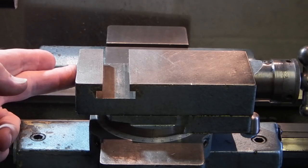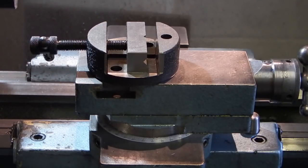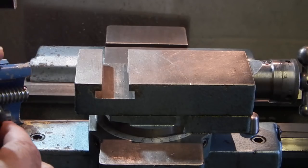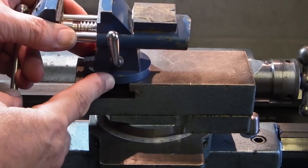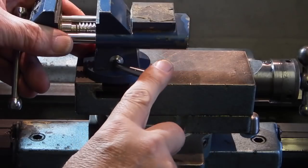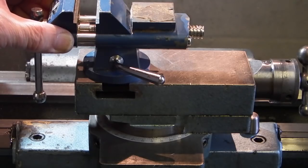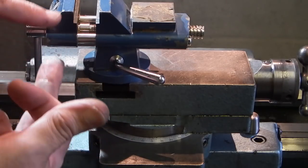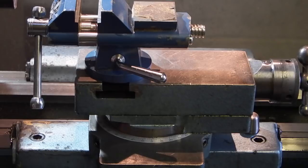This is my compound slide on the lathe and what I want to do is make some way of fixing this onto the compound slide. So when I do milling in a lathe I've got a small vise. In the past I've used this vise which just has a block at the bottom — this slides into the tool post T-slot and locks up on a cam. The problem with this is it's not an accurate vise, there's quite a bit of play here. The other problem is it stands away too far so you get a lot of leverage when you're milling, and it's only held on a cam which I don't really like because if that vibrates loose the whole vise moves.